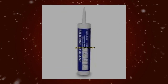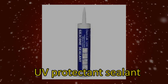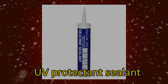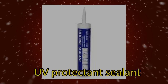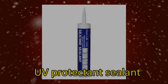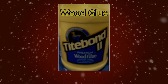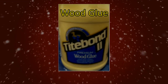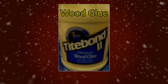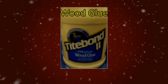UV protector sealant. White. The plywood should be painted with UV protector so that it will last longer in the sun. Any kind will do, but you should at least use high quality as it will be exposed to the sun all day long. A light color is preferred so that it will reflect and not absorb the heat. Wood glue or super glue. I use Gorilla Glue, but anything will do. When you're constructing your frame, some people like to have some glue to hold the pieces together prior to tightening them. I don't do it that way myself, but a lot of people seem to prefer it.